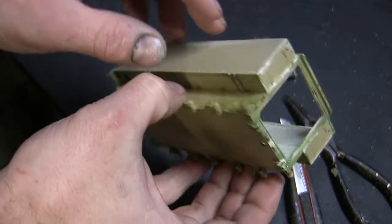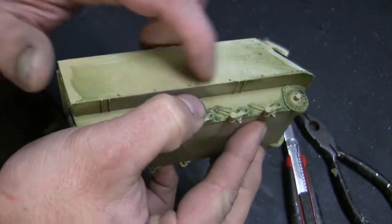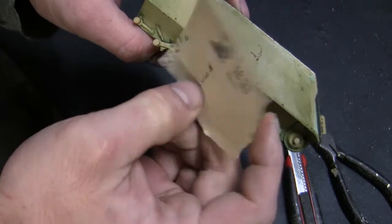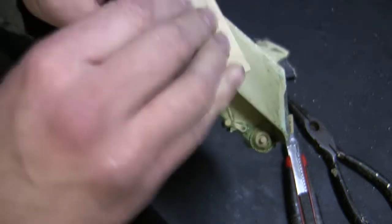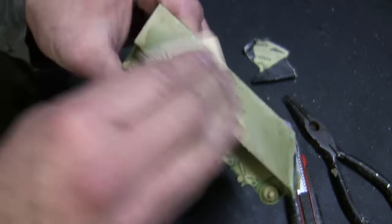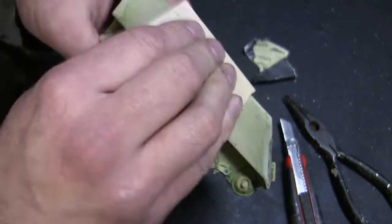On the opposite side, I still need to utilize the same procedure because you see those gouges found on the side, plus some glue marks. First, I'm going to hit it with some 150 grit sandpaper. This is going to basically level off the surface, remove the glue marks, as well as also polish down as much as possible the remainder of the surface. This is in anticipation for the wet sanding that's going to be done with the higher grit sandpaper.